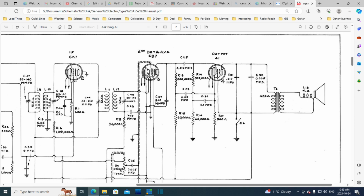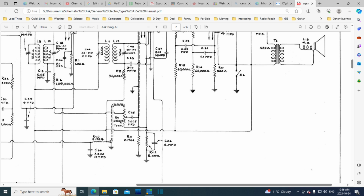Okay, so after being rectified by this diode, the other diode, by the way, is grounded, just as they said, throw it away. I'm not going to use it. Comes down here through a fairly large resistor. Here there's a capacitor to ground. So this side of the coil is grounded. The other side is providing the signal. So now we are coming down here. The capacitor is blocking any DC that's developed in here because of the diode, blocking it from ground. So it's building up. So we have a DC voltage here, 5 or 10 volts. Could be quite a bit more actually. Come down through the resistor, down to this point, where we then enter the shielded cable.